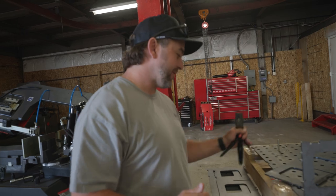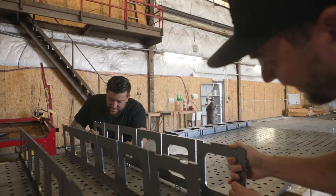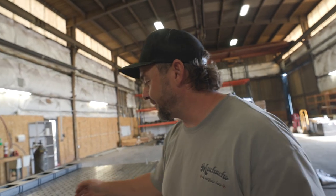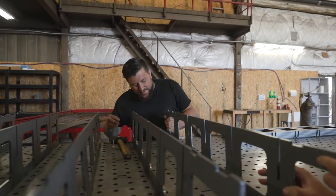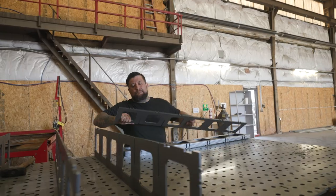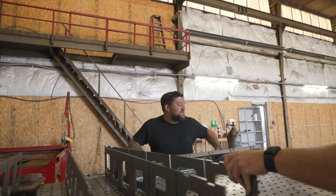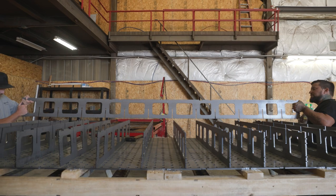They're awesome, you're gonna learn how to build one today. I've always wanted to build one of these. My goal is to have it to where you could use the welder just like that - that's my goal too. One of my goals during all this content is just improving. Sometimes the plates flex a little, so there'll be one in the middle you have to push and hold. Well worth every penny. Just starting out, guys, you'll build flat tables that you can't really clamp to and you tack your parts to them. But these are pretty awesome because you can clamp any part of the table in the middle, whatever, and you don't have to weld to your table - it keeps a nice flat surface.